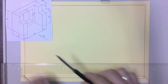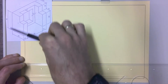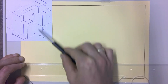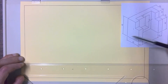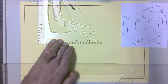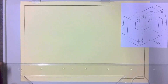For our front view, first we're going to check our sizes. We have a length of 10 plus 40 plus 10, so a total of 60 in length, and the total height is 45. Because we're drawing a front view and a left view, our left view in first angle orthographic is going to come on the right-hand side, so we actually need to start the front view over there on our page. The front view's max height is 45 millimeters, so I can quite comfortably go and measure about 90 millimeters down off the top of my page and make a mark there, and I know I can comfortably start the bottom line of my front view there.